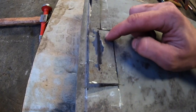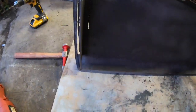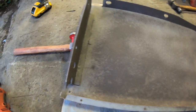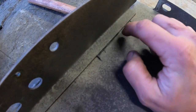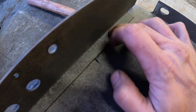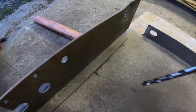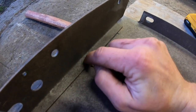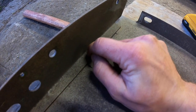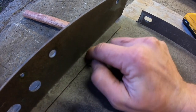And I have two spots here that's holding this. So, what I'm going to do is, I'm going to turn it over. And in here, I'll just have a look for them. I see one there, and I can feel one there. Won't be able to probably see them, but I can feel them anyway. So I'm just going to drill them off, and then you see I can get the little piece of steel off. When I'm finished, when I'm putting my new piece in, I'll just put a couple of tacks of weld in through them holes to fix the new piece.